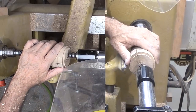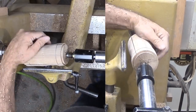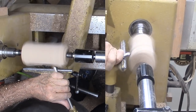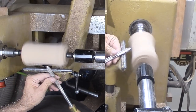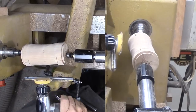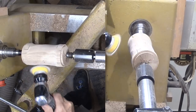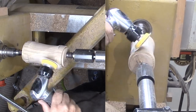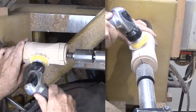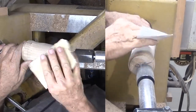Finally, shifting to line number 3 on the headstock and line number 1 on the tailstock end. It is hard to judge the depth of the cove — my best bet is to watch the shadow at the top of the rotating cylinder. Now for some sanding. I'm trying to power sand with 80 grit, but I have to be careful not to sand off the ridges that form between the three coves that spiral up the cylinder.